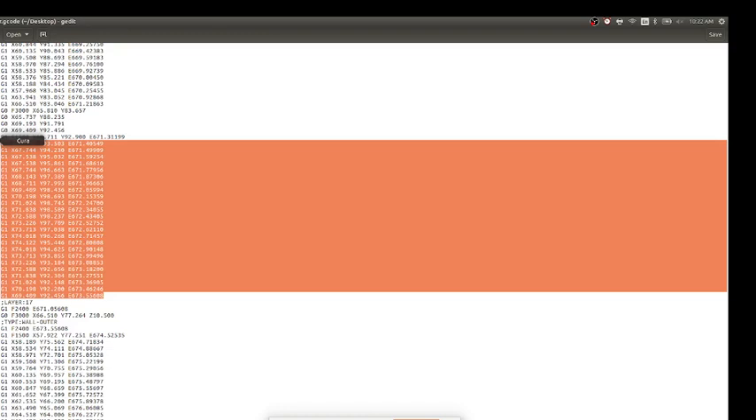First test would be manual. You would do the D9 pin which is plain available — the easiest way to control it. Step by step: we're ready to test this. Just run it with no gas, because you'd only be burning stuff once you're hot. You're just testing everything. We did all the manual testing and everything is still switchable to manually trigger all the solenoids. We have switches for the gas. That's all we've got to test with the new system. So: manual testing, just run it physically, make sure you've got the right motion, do the bed leveling on one side, zero the X and Y, zero the Z, do the bed leveling, then watch it go to the right place in the coordinate system.